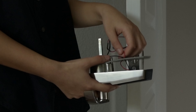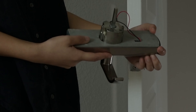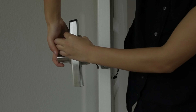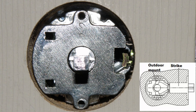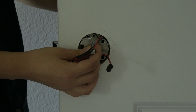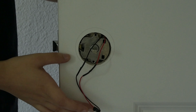Next, insert the outdoor unit. Some keyless door locks may have a gasket or a plate for the door unit. If your unit has one, put the gasket or plate on first, making sure any connective wires are in their proper positions. When you insert the outdoor unit, align the mechanism with the latch. You may need to slightly wiggle the unit in, but do not force it. Try turning the handle of the outdoor unit to make sure it and the latch are functioning and properly installed.